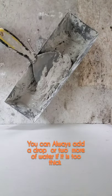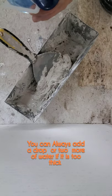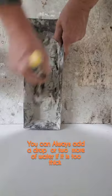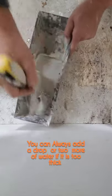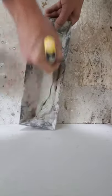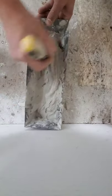I'm gonna add a tiny little bit more water. It's a little bit stiff, just a tad. That's it. Mix that up, twirl it up. If you have a big joint to do, you can always mix say a quarter of a pail of this. If you got a few joints and you want to rush the job, you can do miracles with this. I've done full bathroom jobs with pure sheetrock 20, right to skim coat, and they've come out beautiful. I do not recommend it.